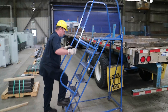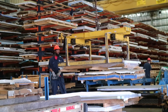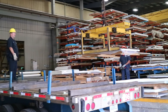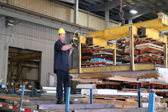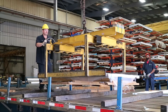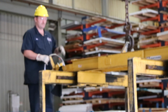Use one of the many available ladders to get onto the trailer. A load on the sheet lifter, like a load on the side hooks, must be landed on board so that the lifter is clear and can be removed. When unhooking a sheet lifter, always reach around the wheel — reaching through the wheel could cause you to break your fingers, hands, or arms.